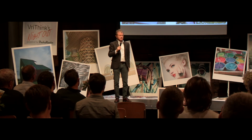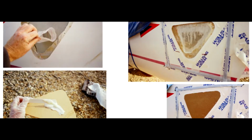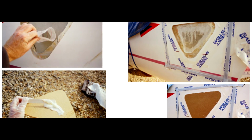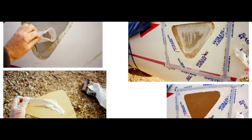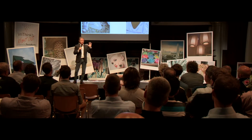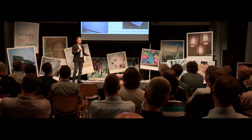Of course, you then come against repairs where you have a sandwich structure, a cored structure. And this kind of repair, again, assessment, very important. Making some cutting patterns is so important. So you can see here, I've made a cutting pattern for the repair, a cutting pattern that comes in handy for cutting the foam, and then I've made a backing pad, which you can see on this far left-hand side, I've glued in place, so I've got something to laminate against. I started off with the biggest patch first. Always start off with the biggest patch first. Gives you the maximum contact surface area.